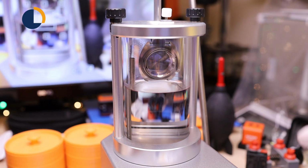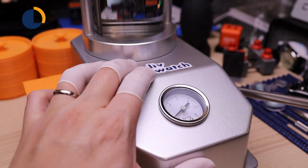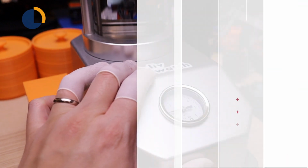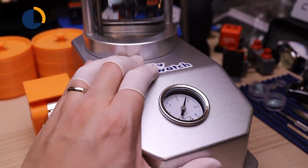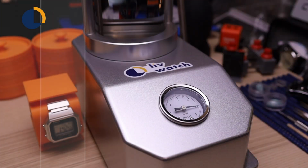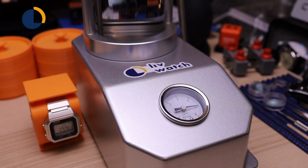For 10 minutes, if there is a leak, the air will have a chance to leak into the watch case and balance the pressure. After I dump the watch beneath the water, I will slowly release the pressure. If there's a tiny steady stream of bubbles coming out of the watch case, it means the water seal is compromised.